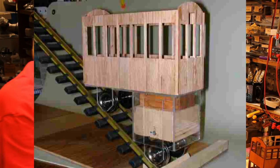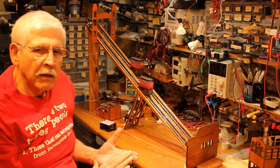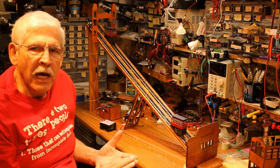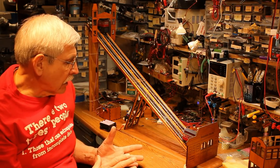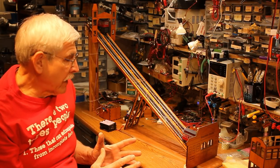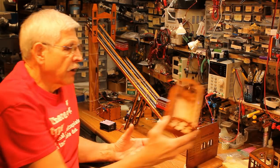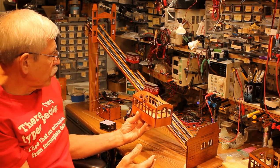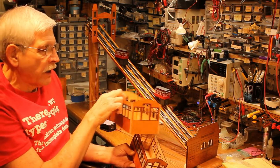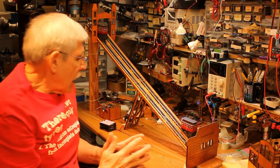When I decided to revisit it in HO, I decided to do a couple of things. The main difference is now I have a laser cutter and I can use a computer to do the design and layout, and let the laser cutter do the tough work of cutting it to size. The beautiful part about a laser cutter is I can very easily scale the drawings — this is about 1/32nd scale and this is about 1/20th scale — so I can make it any size I want.